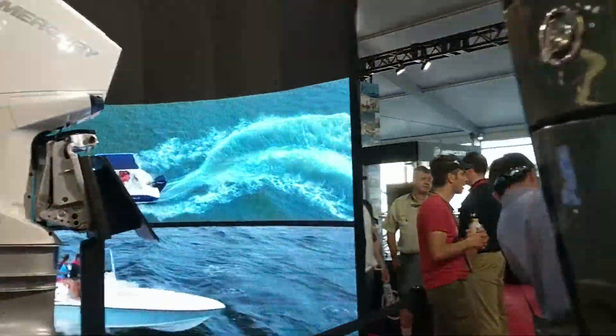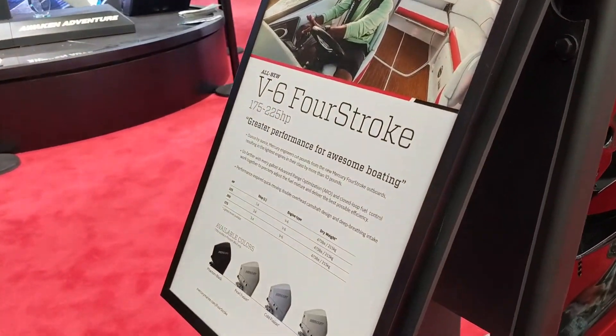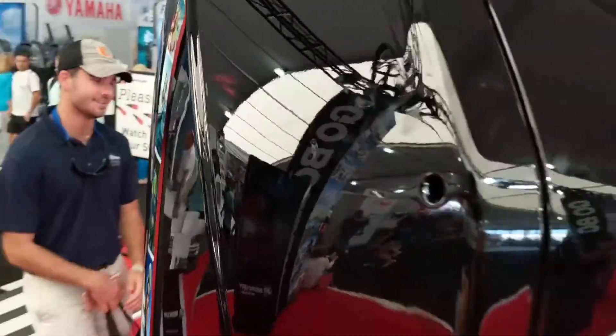The Mercury four-stroke doesn't look the greatest — it hasn't grown on me yet — but everything else I kind of like. It's the lightest of the bunch at 475 pounds. The motor mounts are probably the best of the three: a block-style single mount on top similar to the Verado, die-cast aluminum, and more traditional tube mounts with rubber at the bottom — more rigid than the G2. It also has low water pickups. It's really quiet, and from what I've seen it looks like a pretty good performer.